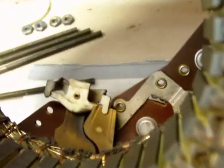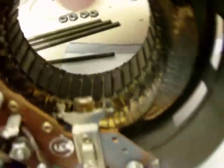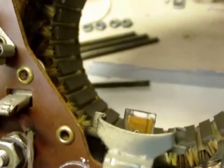This is kind of a learning experience for me, but if it helps anyone else watching the video, that's great. The motor is relatively clean — it operated in a clean environment — and I believe it's in sound condition. After so many years the wires begin to harden up; the insulation hardens, so you'd want to check all of that if you're going to disassemble something like this. The wires feed off of the coil mechanism inside and come through onto this fiberboard bracket, which I'm going to remove — or at least remove the switch from it.